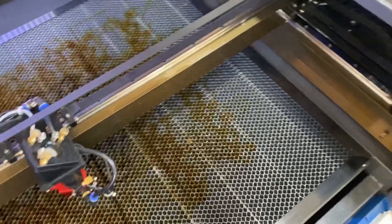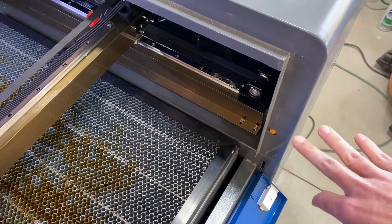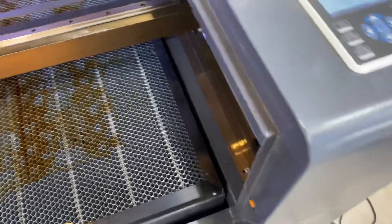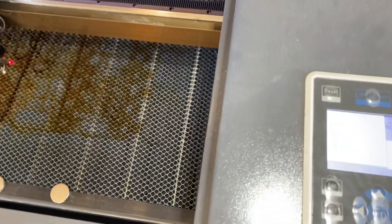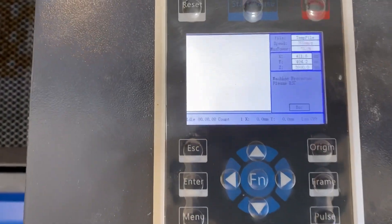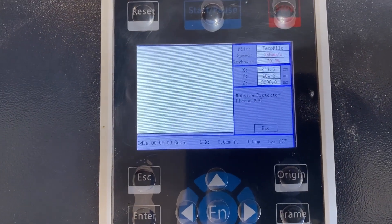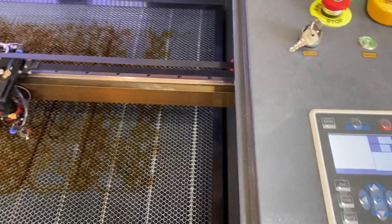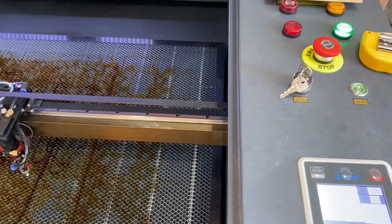Now we are going to look at the second sensor. This is the one that actually does a machine protect on the controller, so it won't let you fire with the lid open. If we come over here and hit the pulse button, it shoots me an error and it says 'machine protect, please escape.' So it's not going to let me fire this laser. I'll show you over at the computer in LightBurn how to turn it off.